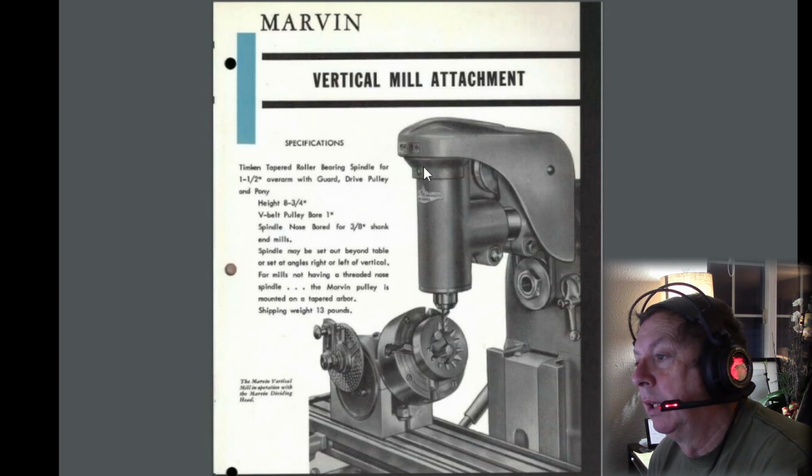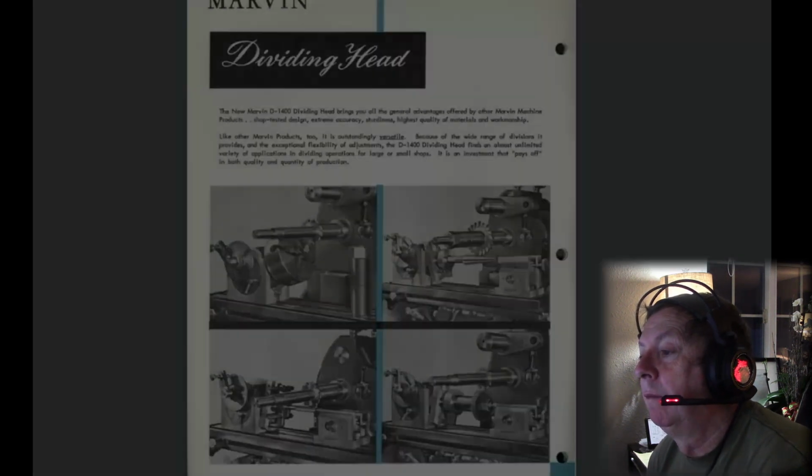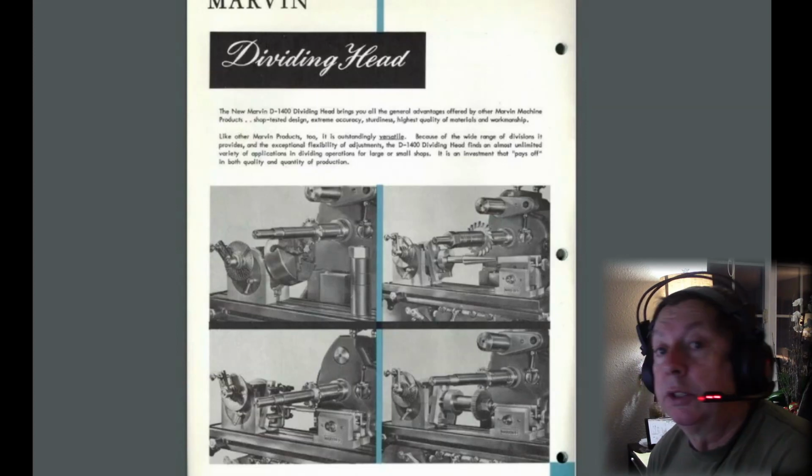I've seen a couple of different little setups for belt guards, but yeah, see, so this took a standard chuck. You could index it. Interesting. Dividing head. It doesn't have the drawbar or the spacer. So it would have taken probably a 3C or a 3AT collet in the spindle nose. Drive dogs, they made a tailstock for it. But yeah, interesting. I just found that kind of unique. Thought I'd share that with you. So there we go there.